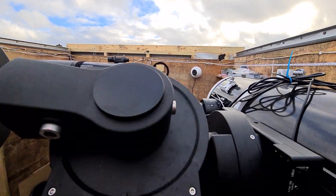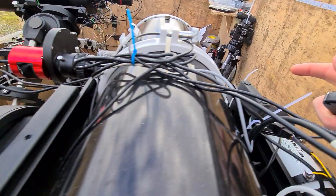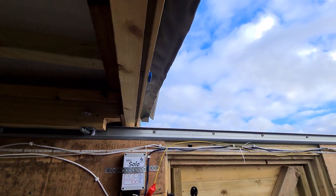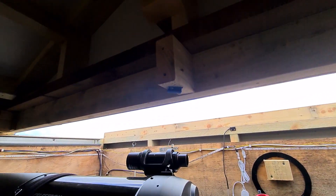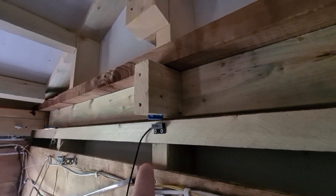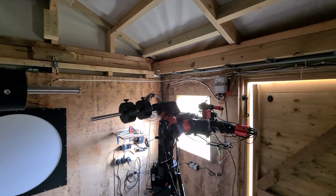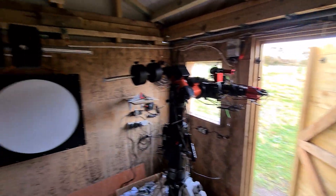I have tilt sensors on each of the mounts — these will register if the mounts are safe, one on each. The little blue magnet on the edge there is another sensor. It's like an alarm on a window — when these magnets are close to each other, the CloudWatcher knows that the roof is closed. That works really well. The CloudWatcher is happy the roof is closed and doesn't try to move it again. I also get an alarm if it doesn't think the roof is closed properly — it will alert me.